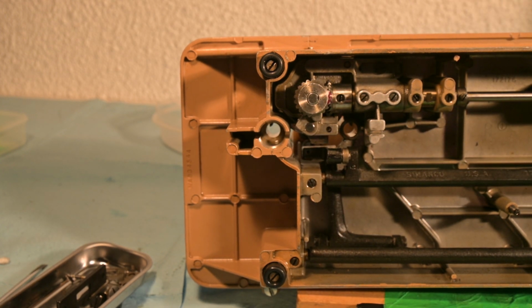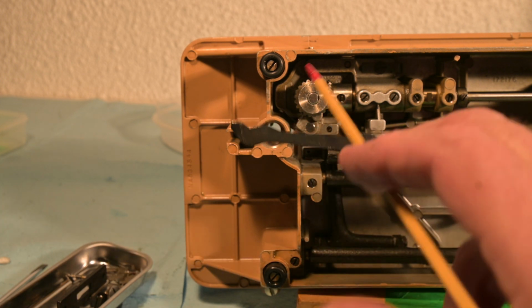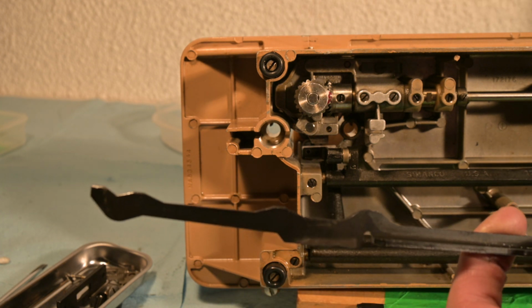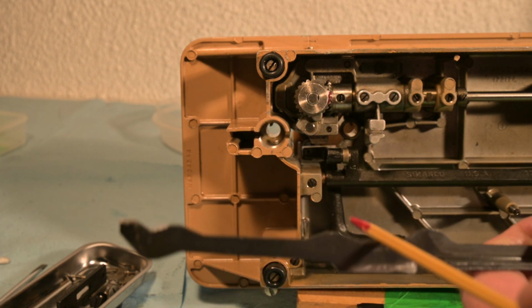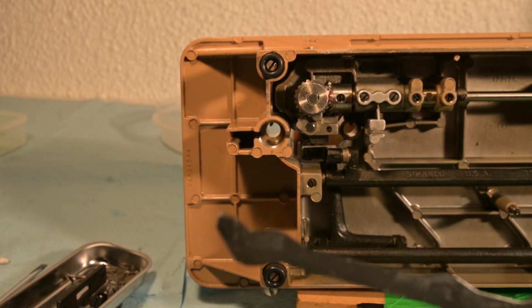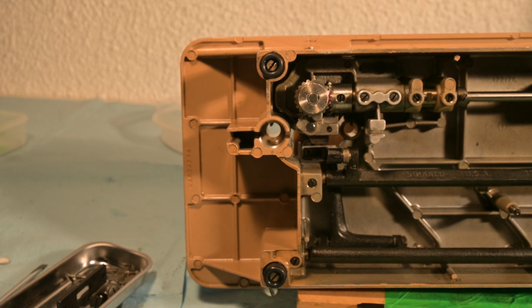And you'll see these bumps there and there. Is it there and there? Or there and there? No, it's there and there. Those are the bumps that push the pins up and down. So as the lever moves back and forth, the pins come down off that bump, whichever direction, I guess that way maybe. And that's how it all happens. But this nut is what applies the pressure to that. And that's all dictated by the springs on the pins.